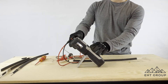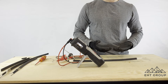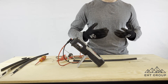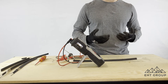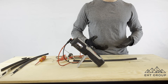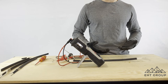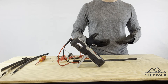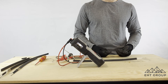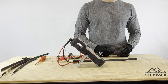The other item to note is the duration of how long you should test your cables under an insulation resistance test. Again, you have to look at what the manufacturers recommend on the cable and what the site standards are. Conducting an insulation resistance test is a destructive test, so we don't love the idea of applying voltage for a long period of time. But again, you're going to need to follow the site standards. That's it everyone — hopefully you found this useful.